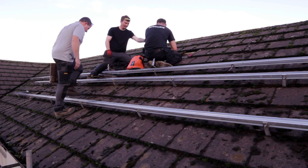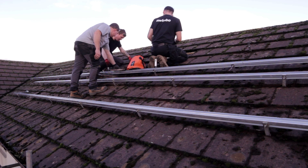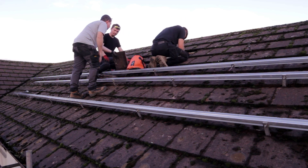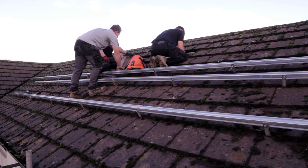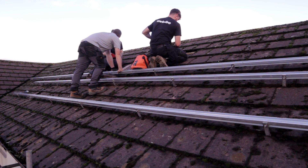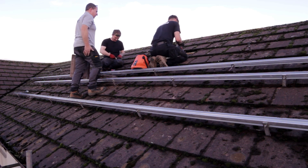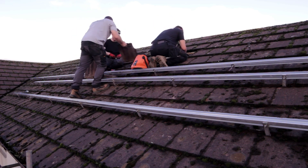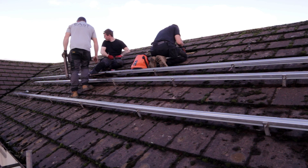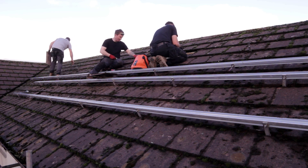It's really important that your contractors work carefully up on the roof. Everything may be all right the day the system is handed over, and it may be fine for weeks, months, even years. But eventually, if that process hasn't been done carefully, you will start to see water ingress — and then that becomes a big headache because of scaffold costs and everything around that. Unfortunately in the solar sector, companies who are rushing their installation practices are often long since gone by the time these faults are noticeable, leaving consumers to pick up the bill.